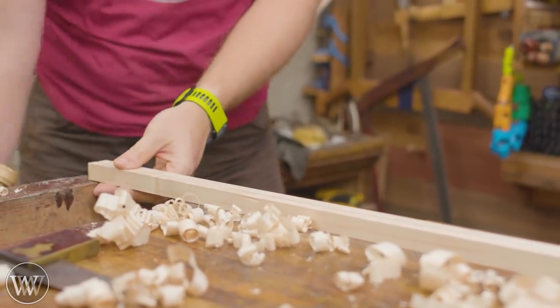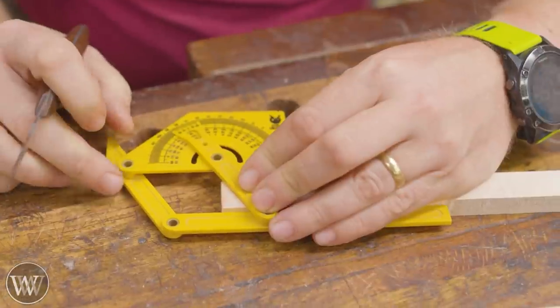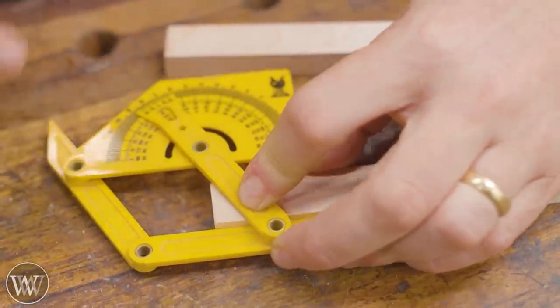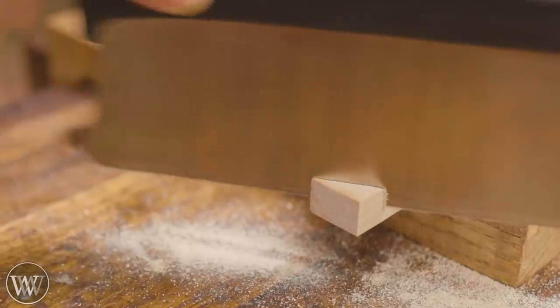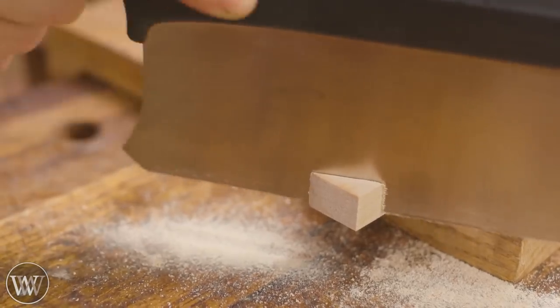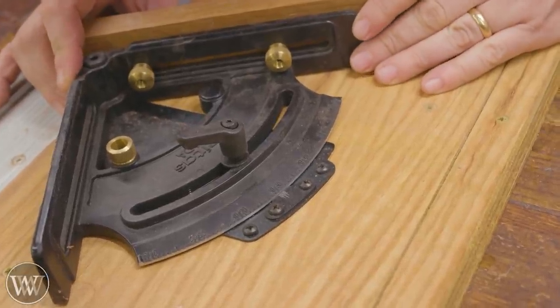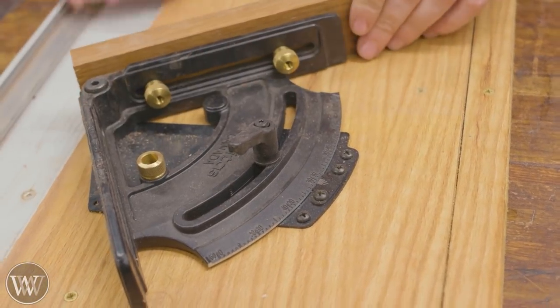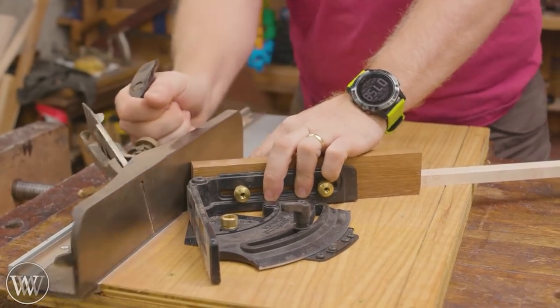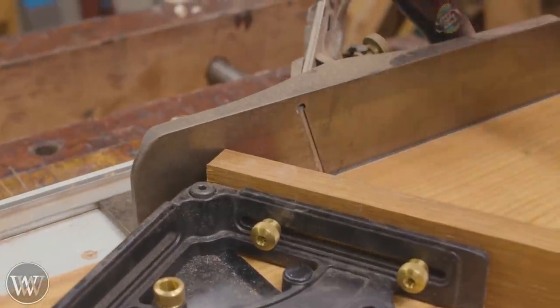Always use your head as a third hand — works phenomenally. Once I've planed one side, we plane the other side and make sure they are 90 degrees to the face. For the first cut I'm just going to use my protractor and find that this is 60 degrees. Hexagons need 60 degrees, and we're going to cut off the end of two of the sticks as my test size. In the future we'll use the shooting board — I actually have a video showing making the shooting board. It has an adjustable fence I really love, and it will give you exactly and precisely a 60-degree angle.